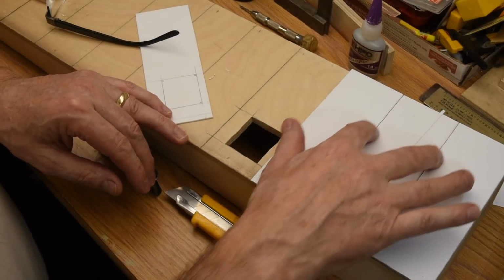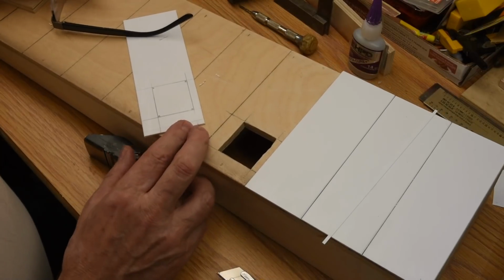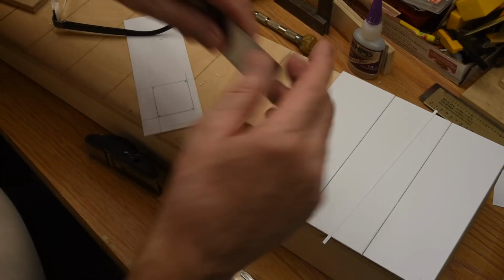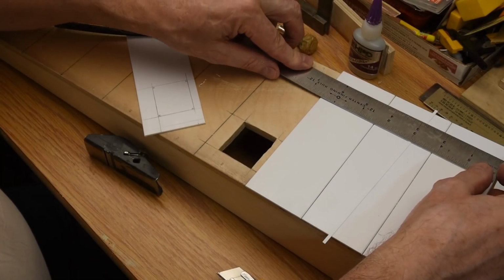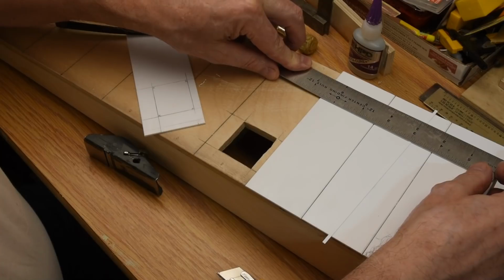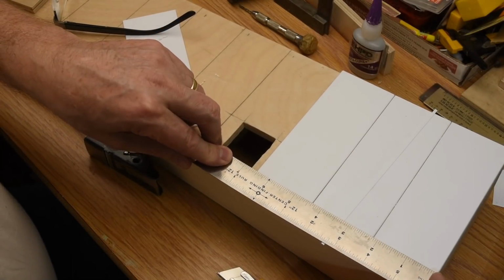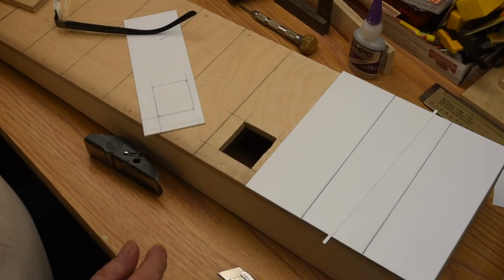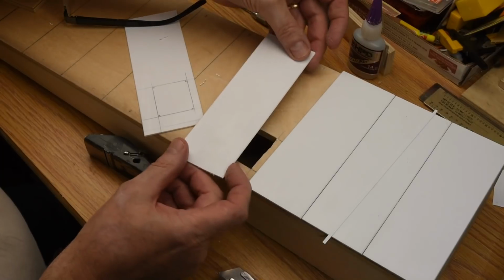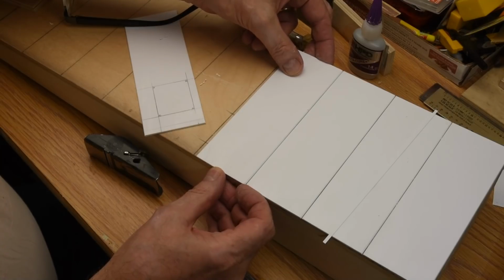See those tilt-up concrete slab lines? Aren't they nice? And we want to make sure, as I think I mentioned before, sorry if I have, we just want to double check for run out. So that's 6 9/16. 6 9/16, so that's good. So I can still run a spacer off that reliably. If my panel is square, sometimes you got to flip them around like this, just to make sure, just double check each one. It's worth the trouble because you get nice clean lines and nice square panels.